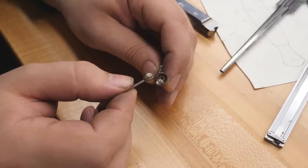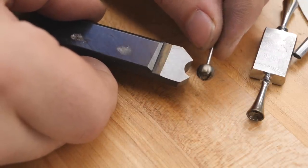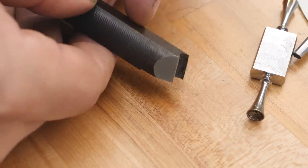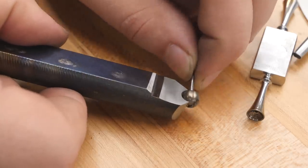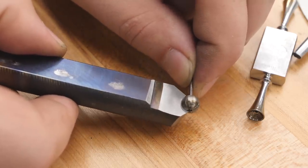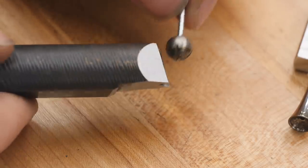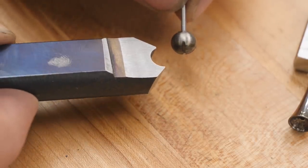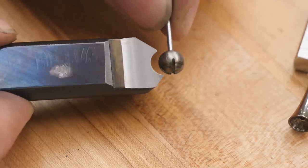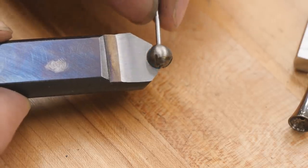There we go — a nice 1/16-inch hole that goes in about 3/8 of an inch deep into the quillian. This is the Clickspring-inspired cutter I made for the lathe. I cut out the slot for the 5/16-inch ball with a 5/16-inch mill bit and it has a little relief on it. Another problem I need to overcome is drilling a hole into the ball about three-quarters of the way in — it needs to be a precision hole just under 1/16-inch so we get a press fit when we stick the pin in. The cutter is some kind of high-carbon steel I had laying around the shop. When I heat treated it, it got rock solid — the file skated right off. Then I tempered it back: the main shank to a blue color and the cutting edge to just a light straw color.